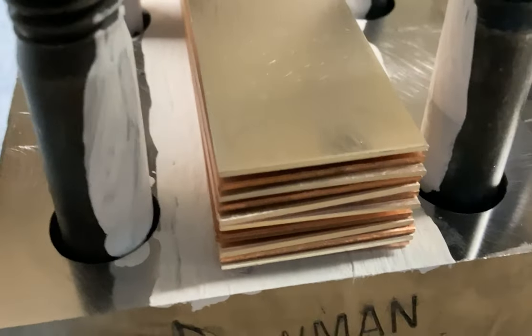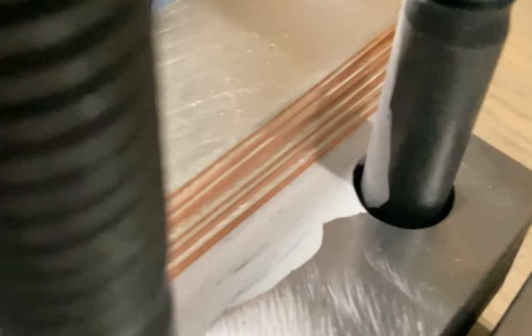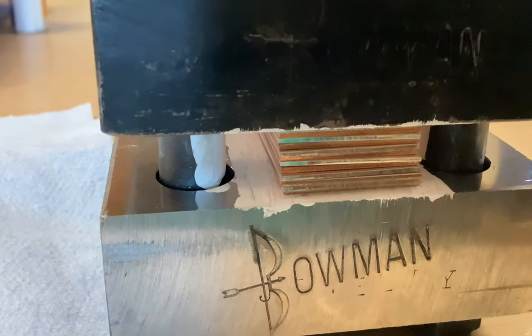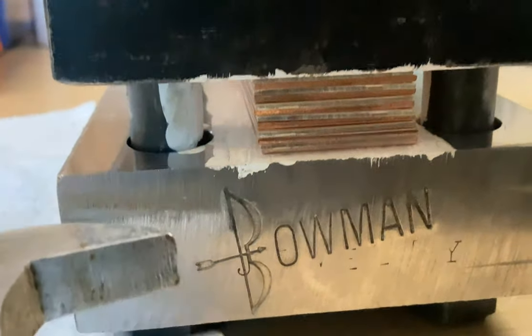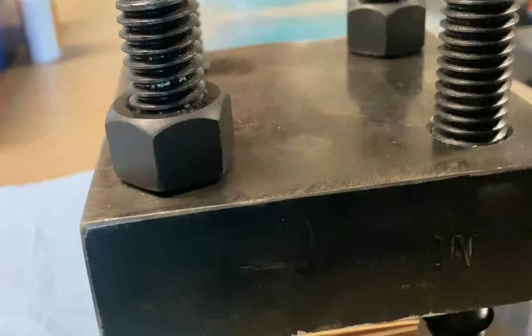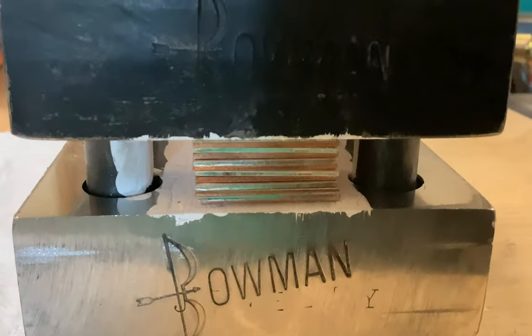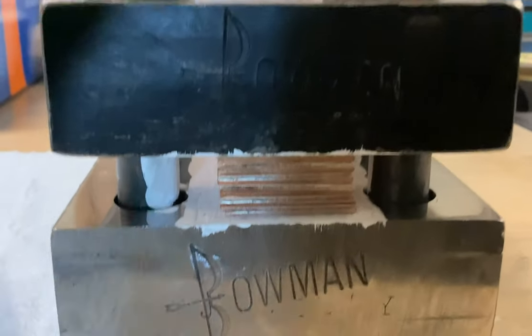This is the stack lined up. What we do is take a ruler and put it flush to the edge, making sure that we have one side justified flush. When you're trying to get the alignment, you've got to get in there with either a wrench or a ruler — that will allow you to justify the edge flush. You do that before you tighten down the nuts on the top of your Torque Plate. If there's any play in the bolt assembly, that can shift your entire Mokume slab. So it's important to get close.